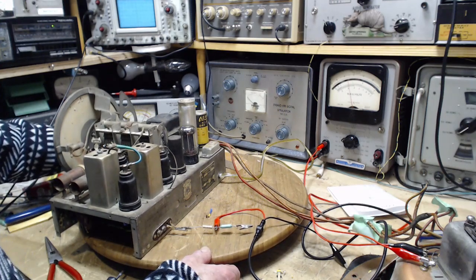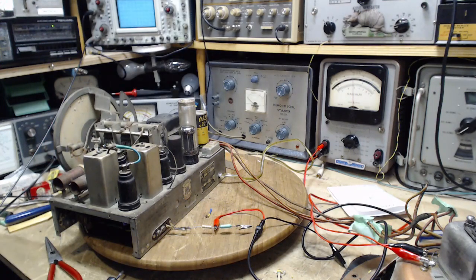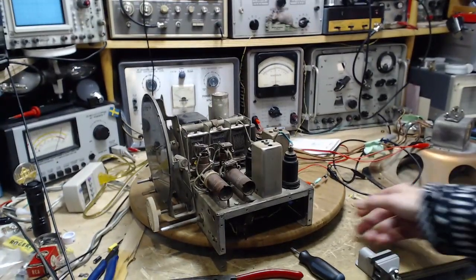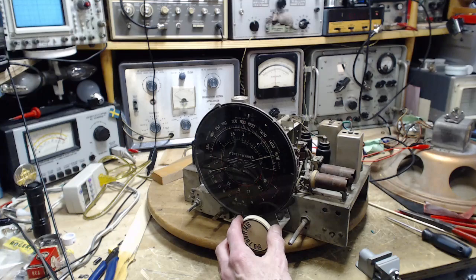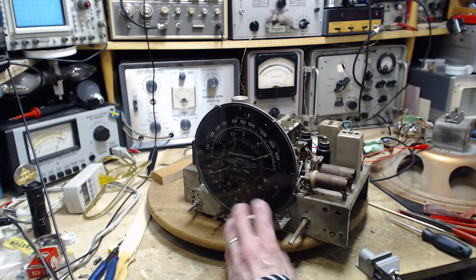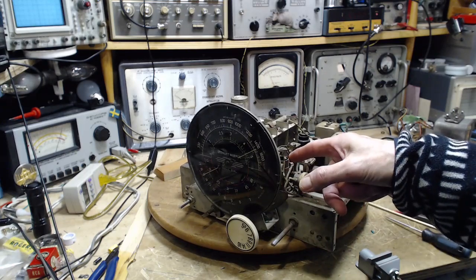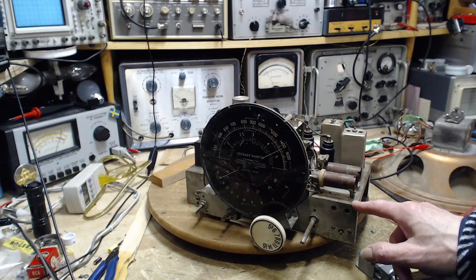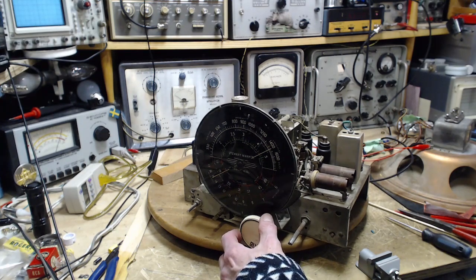It's using the signal generator as an antenna right now. Signal generator still at 5. The radio is breaking into oscillation here. The first thing that comes to mind is that devilish little capacitor I put in back here. That's what that craziness is. What else could it be due to? The way I have the antenna connected? Let's see if we can make that happen again.